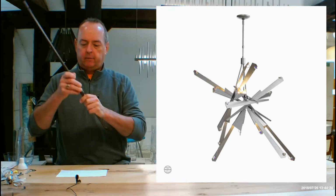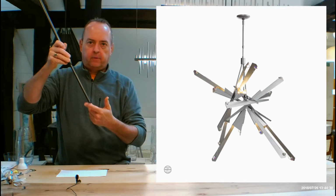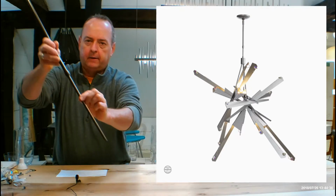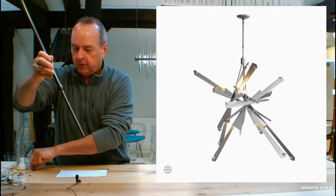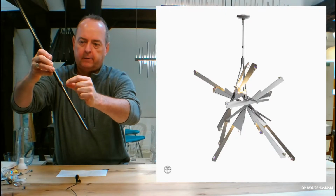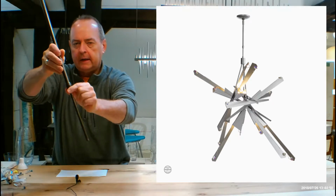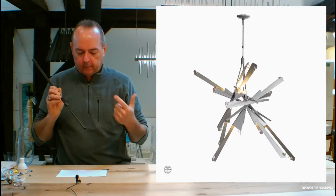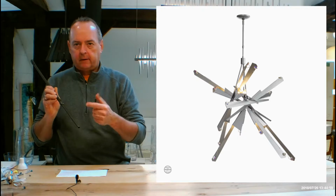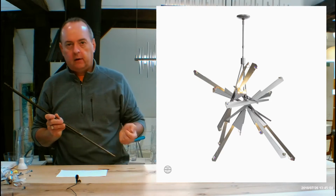When we do that, we're talking about the addition of the adjustable ranges or the fixed. In this situation, it starts off as a fixed height. If you're familiar with Hubbardton Forge, they have a patent on this telescoping rod idea. There's a little hex nut right there, and it ships with this little tiny wrench. What that does is it tightens up this little hex nut that pushes against a friction sleeve, a plastic sleeve inside of this piece right there, and that keeps this from going up and down. But like I said, at the very beginning, you have a short, standard, and long with this fixture. The short starts off at 50.6, and that's going to be a fixed height, not going to be able to go up and down from there. Anything after that is going to be adjustable.